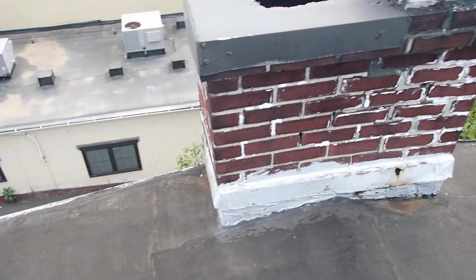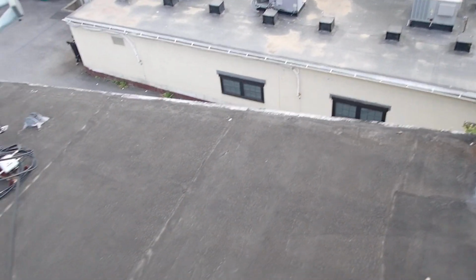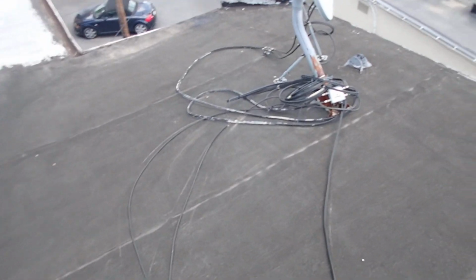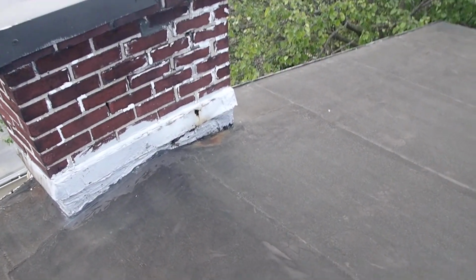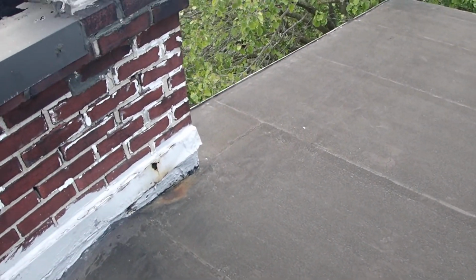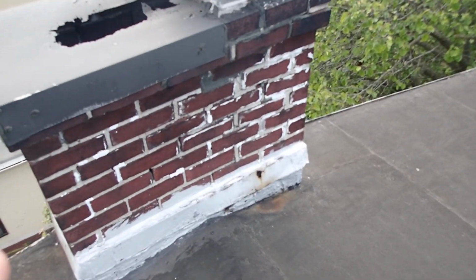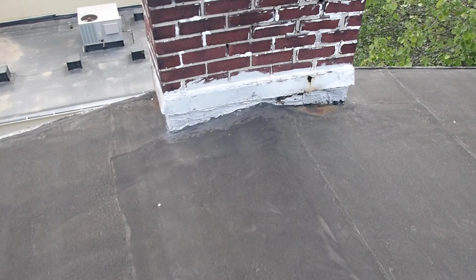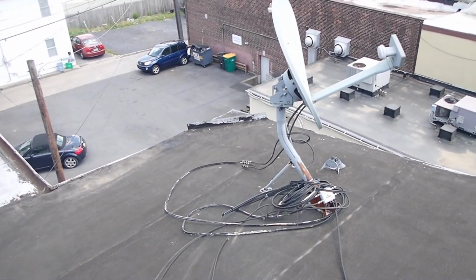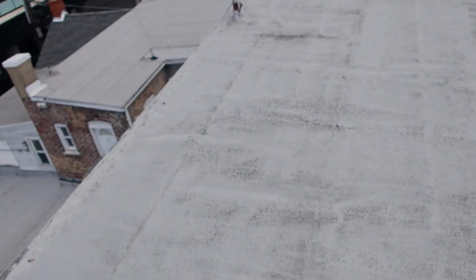If you end up going with installing a new boiler, I would recommend a high efficiency unit. One, they're more efficient. Two, you won't need this anymore, so you could sort of lop it off at the roof line and won't have to worry about it. But the roof, it's not bad. Just keep after the silver coating and you should be all right.